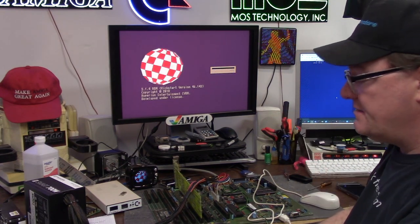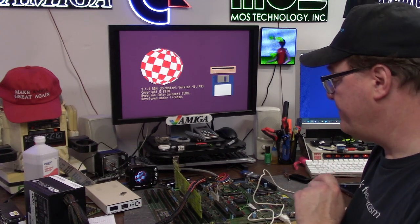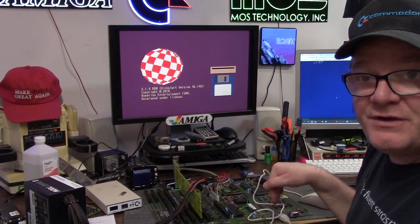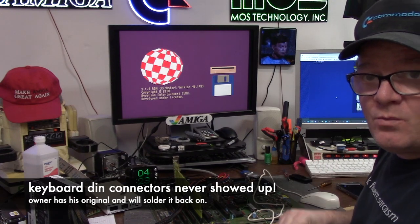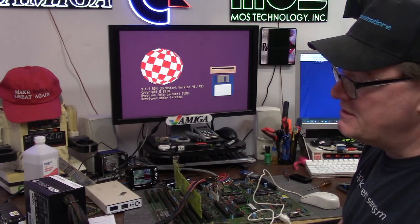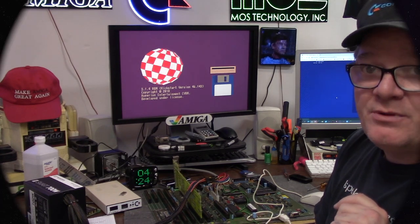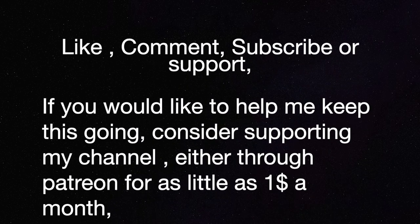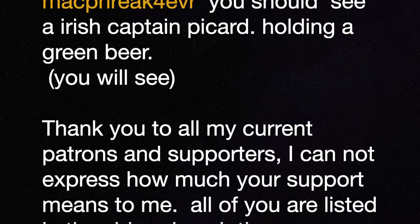That is all I got for repair number two for Mr. Ricardo. Thank you for sending in that bridge board — we're going to look at that shortly in the future. But for now, your second board has been repaired. I'm going to finish with the green solder masking and just get this thing touched up a little bit, and put Kapton tape on the bottom where I got those 31 solder points all wired together. Another Amiga is saved. Thank you guys for watching — subscribe and click the little bell so you know when I'm making another video. I hope you learned something. I'll see you next time.